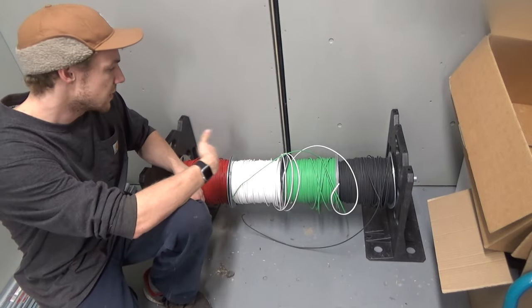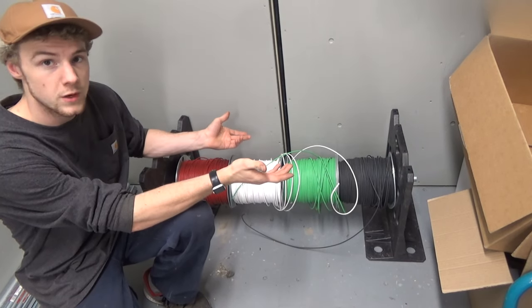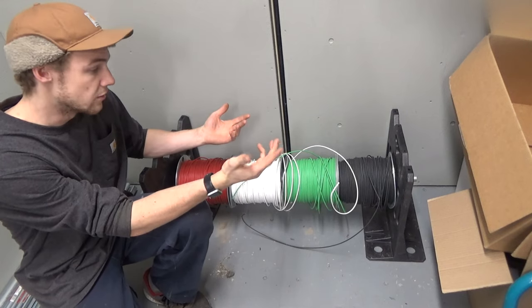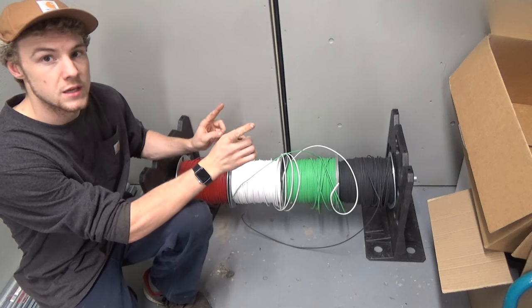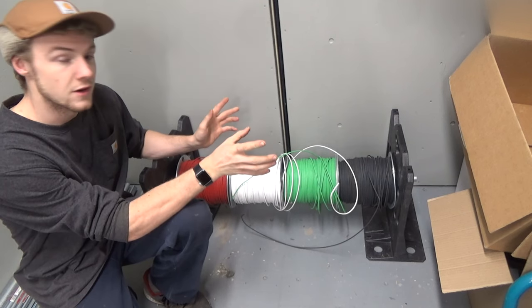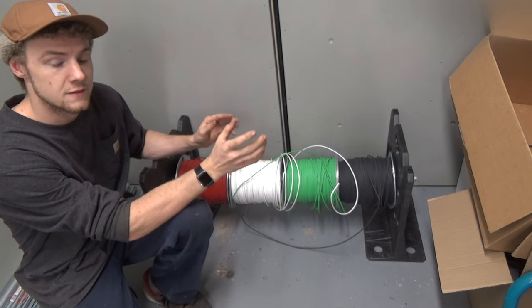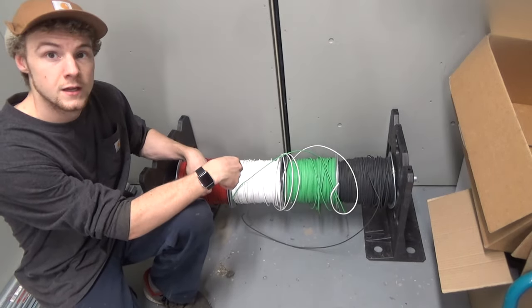Overkill. But yeah, because we're not three phase here, we're single phase, 3 wire service, 3 wire sub panel. There's no blue, but there is a red and a black, and we're maintaining the red and black to each line coming from the house as if this was an environment where you have 3 colors and you have to maintain phase rotation and coloring throughout. But yeah, let's get pulling.